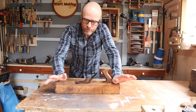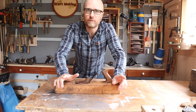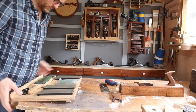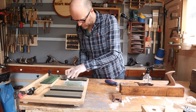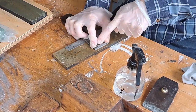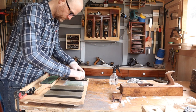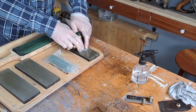That did a really good job for a very rough sharpen. But if I'm going to use this, it really has to improve. So let me try that one more time, doing a proper sharpen on that blade. I got the proper workstation out. I spent around about 45 minutes just trying to flatten the back on this 180 grit diamond stone. Then I redid the entirety of the 25 degree bevel and put a 30 degree micro bevel on it using the proper stones — 400, 600 and 1,000 grit — finishing it with the strop.